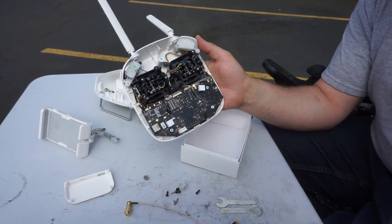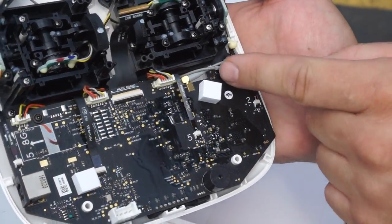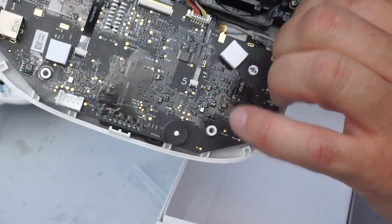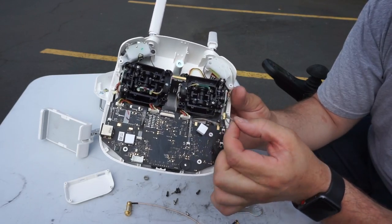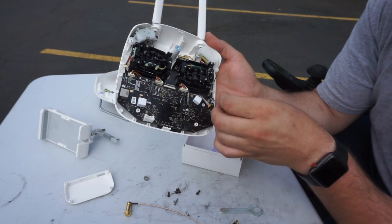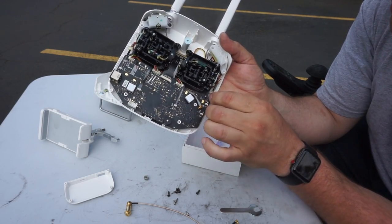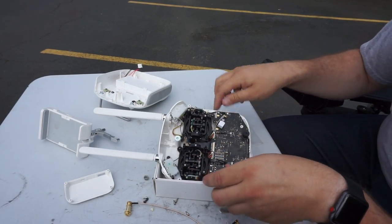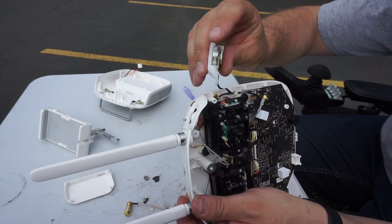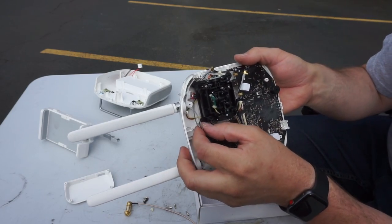It looks like our antenna wires come down and plug in at these two little points right here. There's some little blobs of glue over here too that looks like have to come off. Probably should have brought some tweezers. These little antenna wires basically pop off — you have to use just a little bit of force with a small flat blade and they come right off. Very carefully pull these wires through. There's a ribbon cable on this side and a bunch of glue holding everything down, so you've got to be really careful not to damage the ribbon cables. Looks like we're going to have to remove this joystick to get the cables to clear underneath, and also remove the other little dial here. Now we should be able to lift this up just enough to get that wire with the connector on it to pass through.